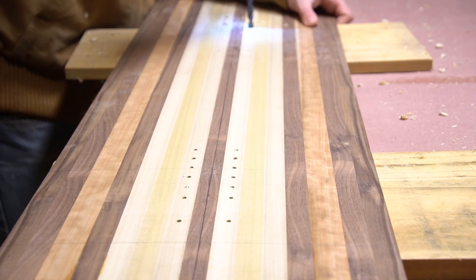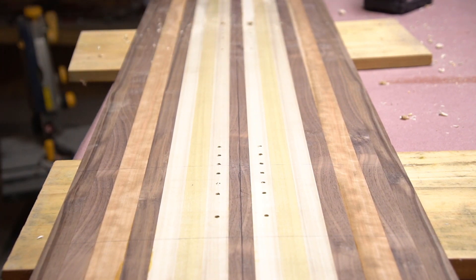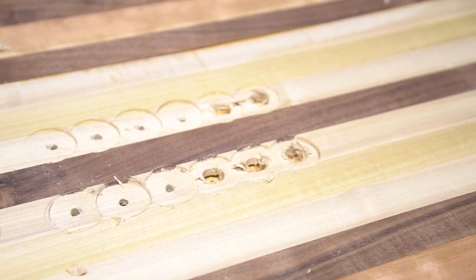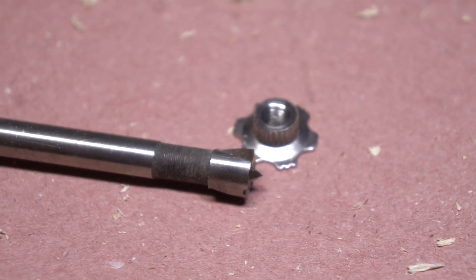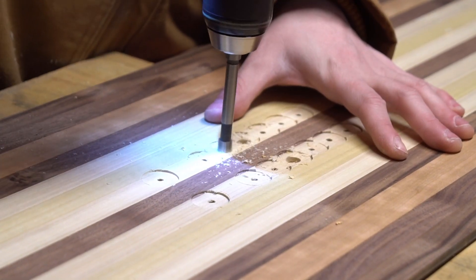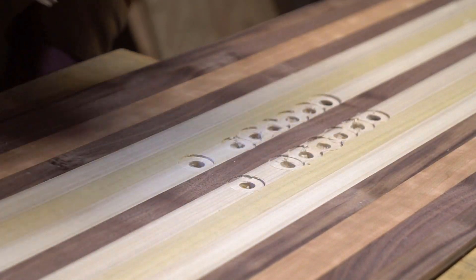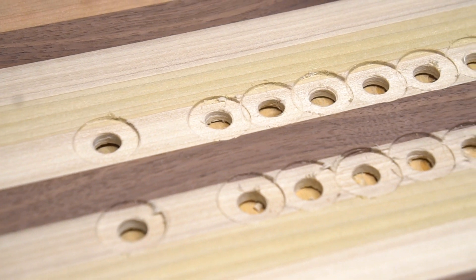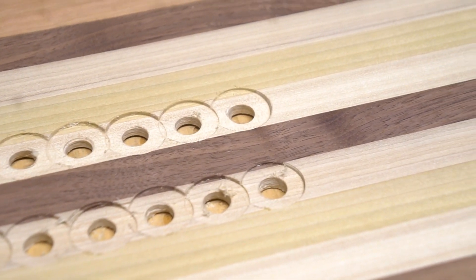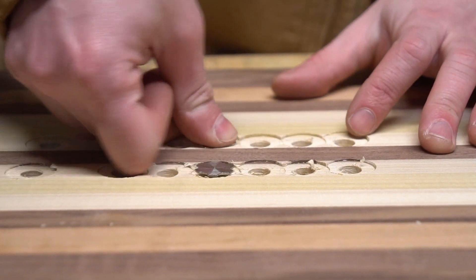For hand drilling I think that actually came out pretty good. Next I need to drill for the threaded sections of the inserts. At first I tried using a twist bit, but holy hell that made a huge mess of things — I don't know if my bit is dull or what. I'm not too concerned about the strength here since this whole area is going to be glassed and flooded with resin, but let's see if we can get some nicer-looking results. I switched over to a second, smaller Forstner bit — these take a little longer than a twist or spade bit, but they're specifically designed to leave a really nice, clean-edged hole. And yeah, look at that — that's just much nicer. I bet if I'd used my drill press we'd be looking at even cleaner results, approaching what you could see from a CNC router.